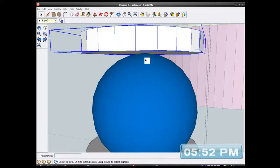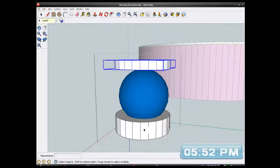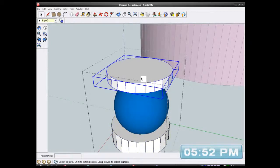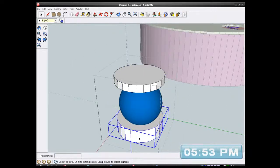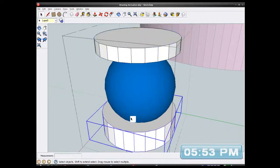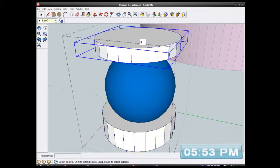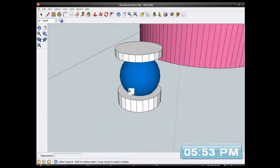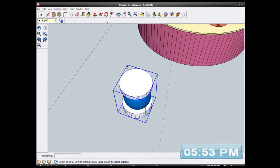I used some acetone ABS plastic gooey stuff. I put it all around the ball, then I put the ball and that top adjustment down here, I slid it all into the hole, so that this end spacer down here will glue and bind onto the ball, so that when I turn this bottom thing here, the whole thing will turn, so that this will turn as well, because it will be stuck to the bottom of the ball. And because of that being eccentric at the bottom, because that's off centre, as this rotates, the ball will also be eccentric relative to this end one, because it's stuck in an eccentric position already on the plastic. So the whole assembly, all of it, will basically rotate.